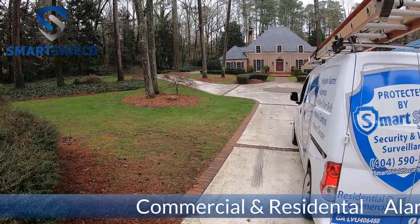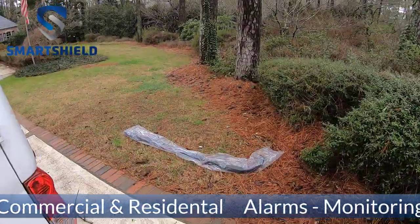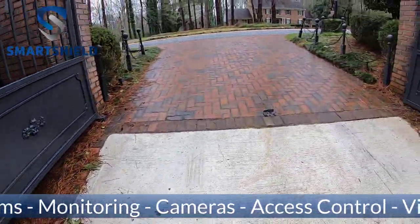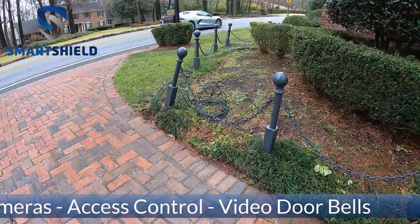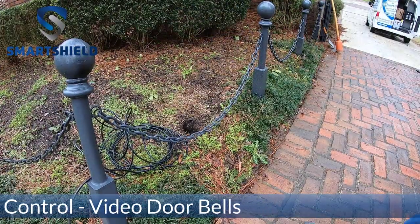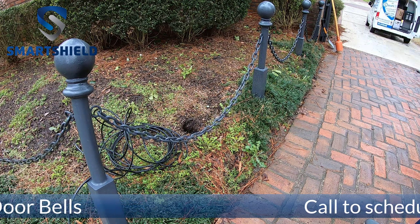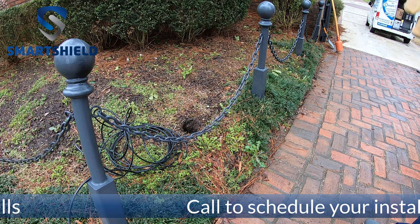On that side of the house is where our modem's at. Here's our pole - it's about 72 inches. We need this thing, so we're going to drop about 30 inches in the ground because we want that thing to sit right at about 40 inches. Got a bag of concrete, we'll set that in there. All right guys, I got it marked out just about where I want the hole right there, so we need to go down about 27 inches.